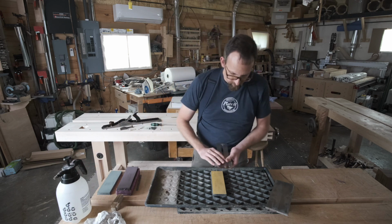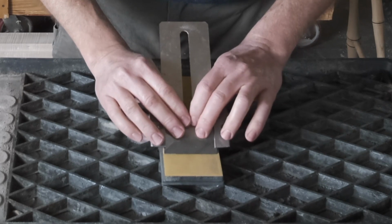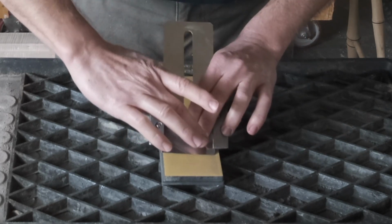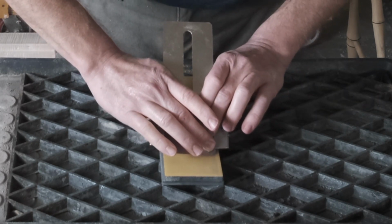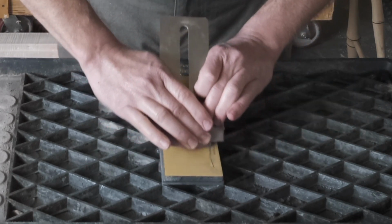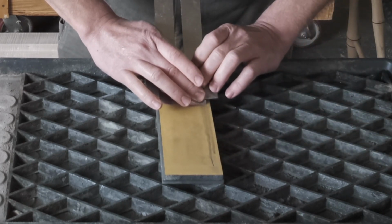I just flatten these stones so they're ready to cut. So I've got just enough stone here to make this happen. I'm going to reach all the way across with my middle finger, and I'm going to press down on the back of that blade right above where it touches on the stone. And I'm really going to push hard, and I'm going to pull back. And you can see all of the swarf on the stone is right there in that one concentrated spot.